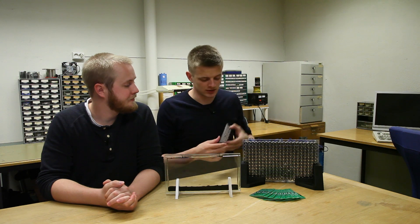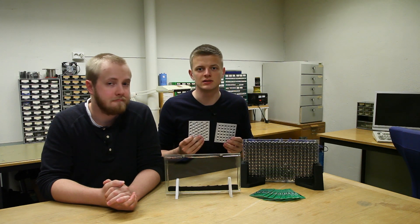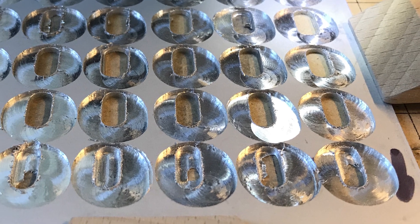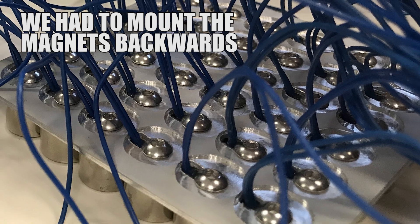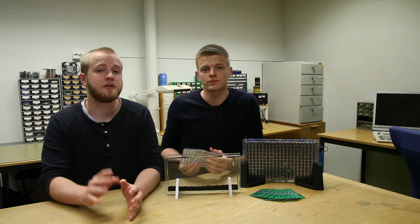In our prototype we had used aluminum plates for this job, but we didn't have access to a well-functioning CNC mill and the results we achieved in our prototype were not something we were willing to accept in the full-scale version. So we looked around for a professional CNC machinist that could do this for cheap, but after a while we just decided to change our approach. We did some small changes to our design which made it possible to use laser cut acrylic instead of aluminum, but we had never laser cut anything before so we asked Krister for help.